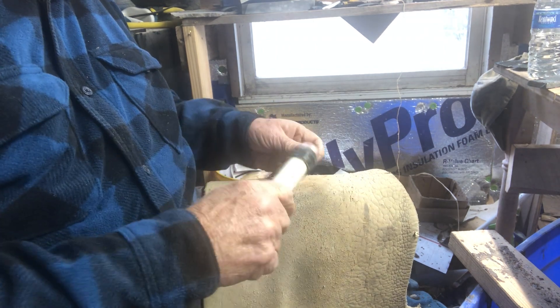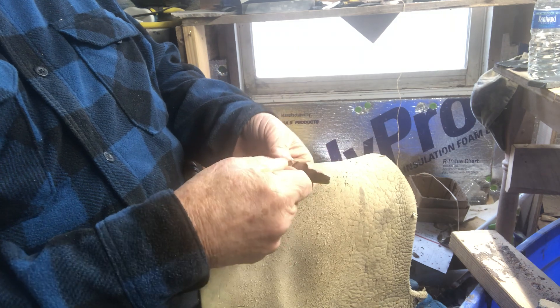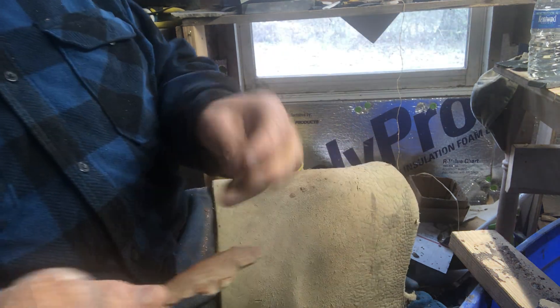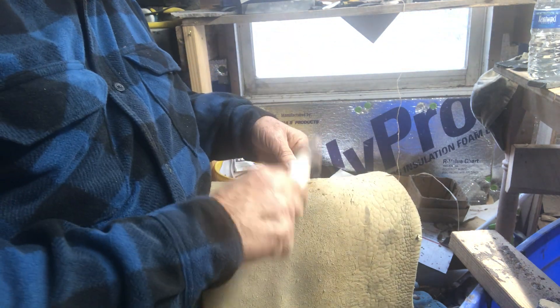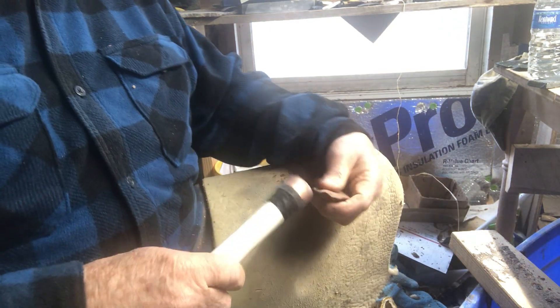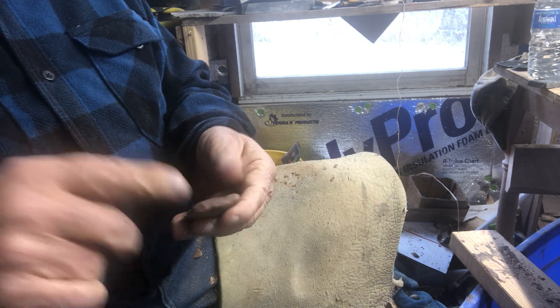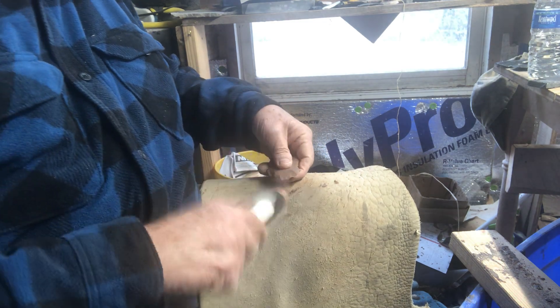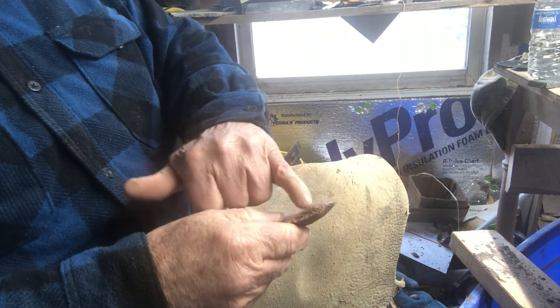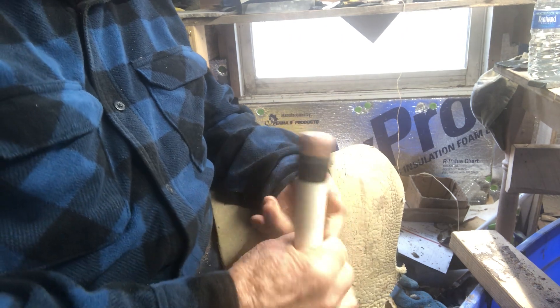Now I'm going to angle down this way, grind it, and show you what I'm talking about. By angling down this way I made a little point right there. I'm going to turn this billet this way and get in there — look at the mass it took off. So I'm going to come back and lose some more of the point; it's still going to be shorter before I get finished. I need to run some off following this ridge. It's starting to shape up now. I'm going to get that big old hinge around the corner — that was in it before I started hitting, a big old crack — but where I hit it, it didn't go far before heat treatment. It was already there before heat treating and now it's gone.